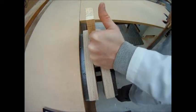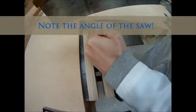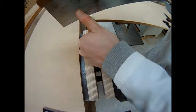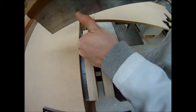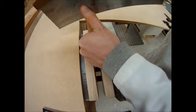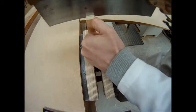Make this hand shape and use your thumb to guide the saw when starting. Note the angle of the saw. We are just concerned with cutting the extreme tip of the material at the moment. Pull the saw back two or three times to create a little groove. As the saw begins to bite you can start to lower the saw into the material. You are now cutting with the grain or parallel to the grain.